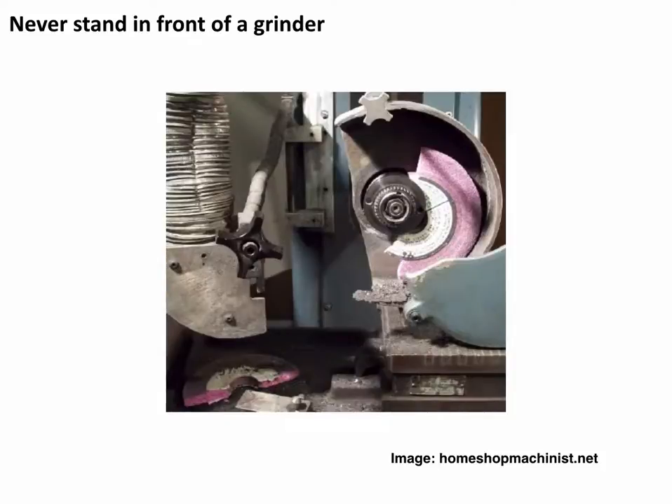One that a lot of people don't think about is grinders. They're in use very commonly in a lot of labs, but the grinding wheel itself is very brittle and can — and probably will at some point — explode. Each of those fragments can contain a pretty comparable amount of energy to a nine-millimeter bullet. So you always want to stand slightly off to the side when using the tool to grind anything at all. It's just good common safety practice. Even though they have guards, there are still pieces that will make it out to you.